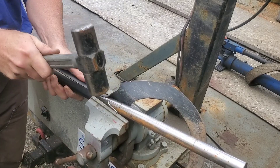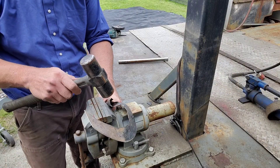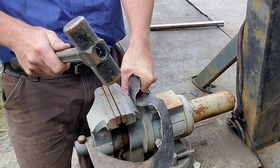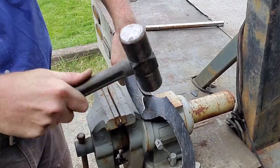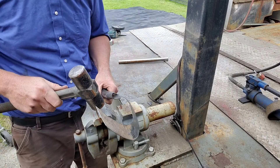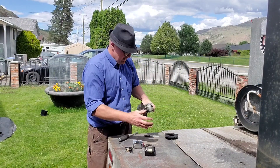The shafting I'm using is an off-cut — a one-inch shaft — that's just going to help me fold over the inside metal handle to make it look a little more factory. It worked out quite well: sticking it in the crook here and rolling it a little with my hand just to tap it over to give it that oval shape. To me it looks pretty factory actually, and I'm pretty happy with it so far.